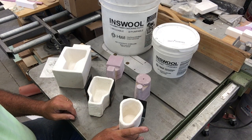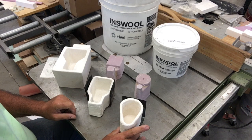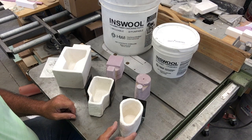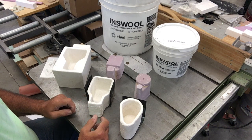This smaller one I've actually got two of — I made a spare. I've got somewhere between 50 and 100 pours on it; I stopped counting and can't remember which one I used more, but I've used them a lot repeatedly. One other thing about the material is it tenaciously bonds to itself, so if you damage or crack one you can just dig out the crack, pack it full of the material, and fire it again and it's good as new.